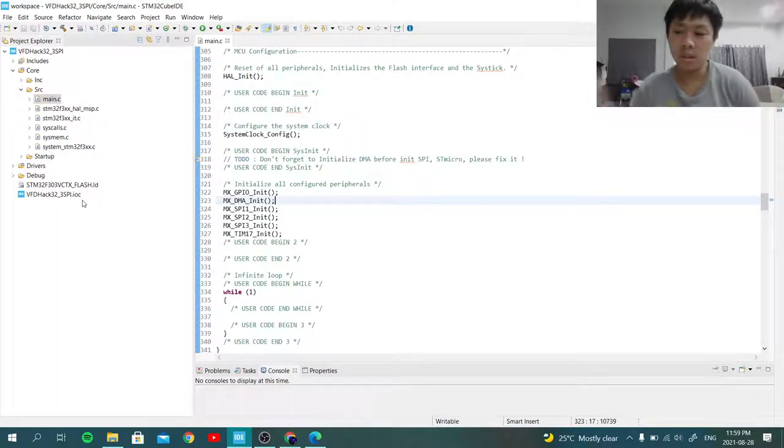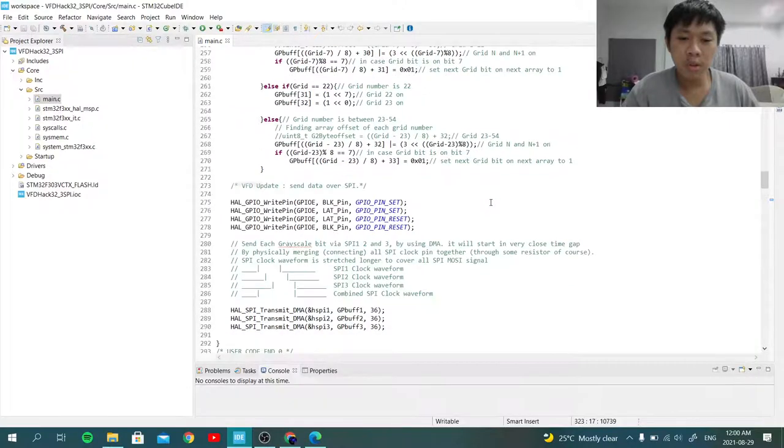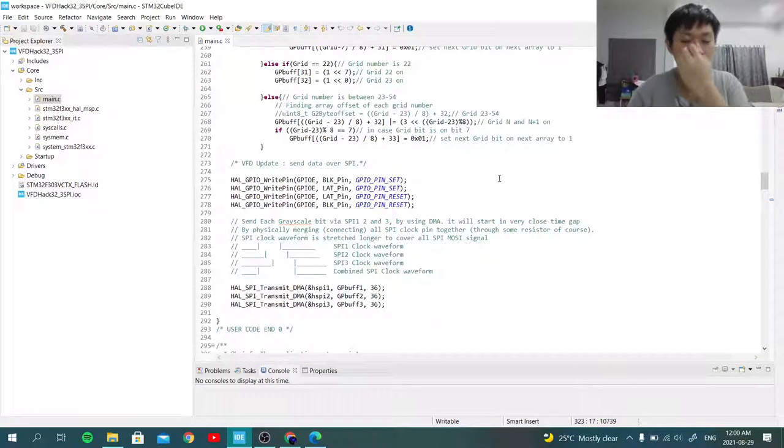And as I said earlier, I use Arduino as a logic analyzer. This cannot capture a fast signal. Right now I push the SPI to a maximum of 18 MHz, and that is way too fast for my Arduino to capture. I might slow it down to about 500 kHz so my Arduino can capture it, and see if the waveform is actually correct, like what I have predicted. Also, I need to send some dummy data, because I don't want to build the complete version yet.